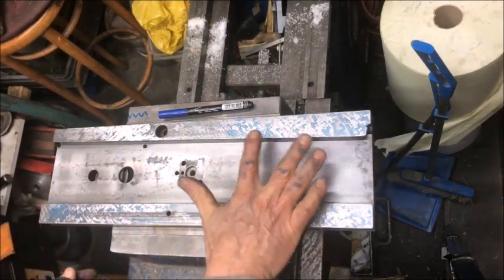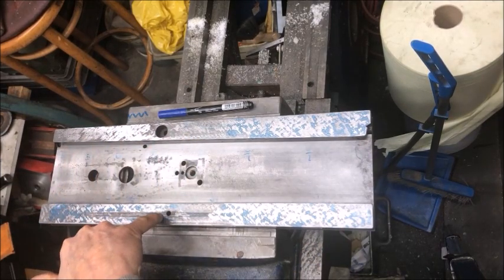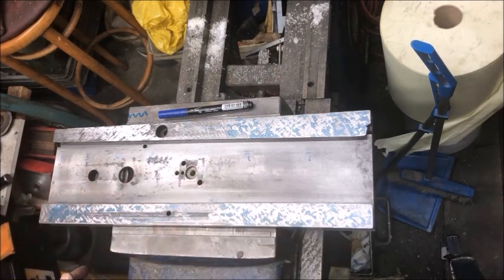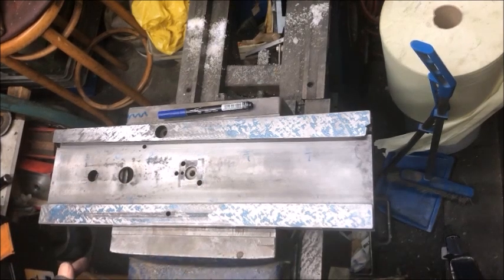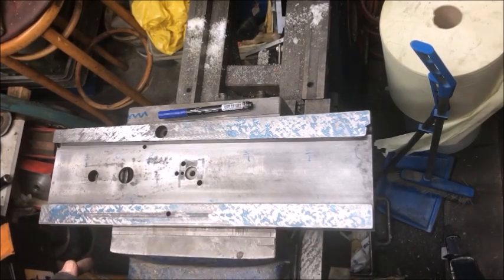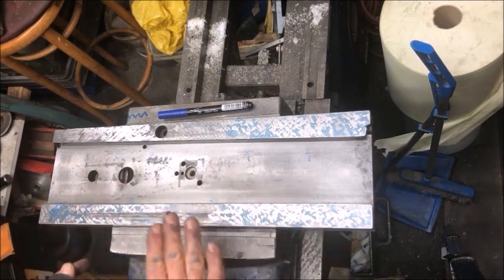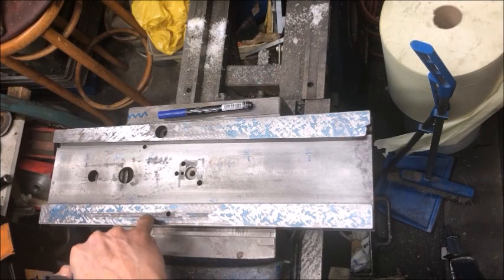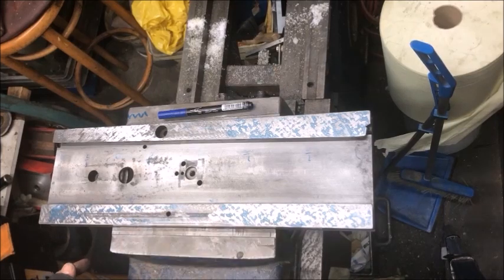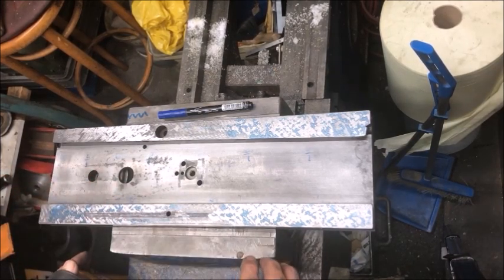I'm taking it in careful steps here, just following the spotted blue areas. You could really just use yellow Canode, paint it all, and whack it until you get below the lowest area — in this case where the ridge is — but the risk is that you lose control and overdo it. So I take it in steps because I don't see the point in stressing this.